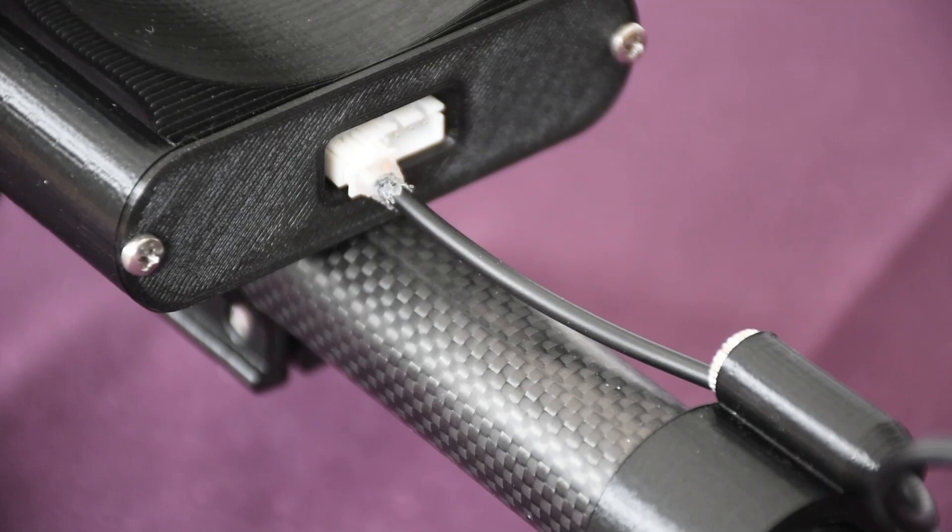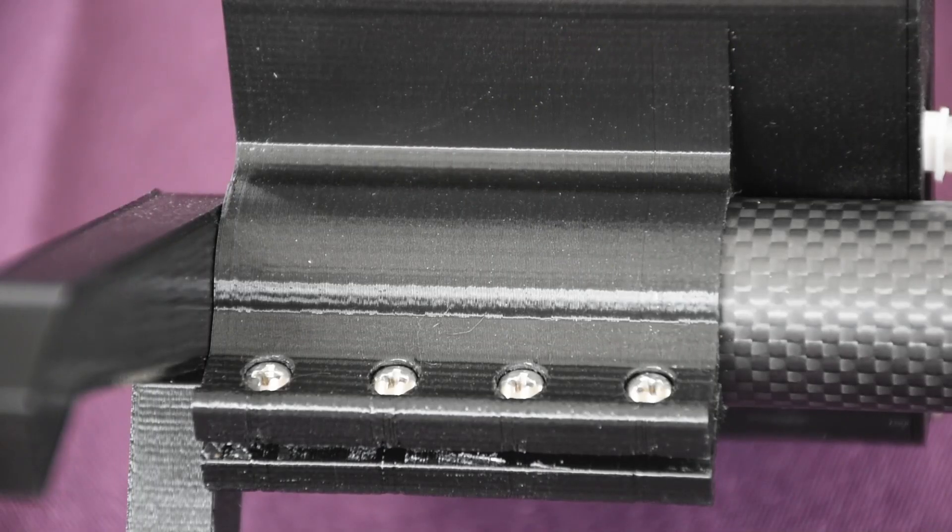The cuff on the PL4 is held on by friction, but there are four bolts or screws which hold the clamp together. It's important not to loosen them one by one — you do them up or undo them one at a time, perhaps half a turn each. You do half a turn on one, go to the next, half a turn, next one half a turn, and keep doing that so you're tightening or undoing evenly.